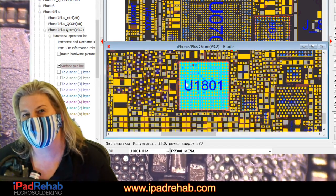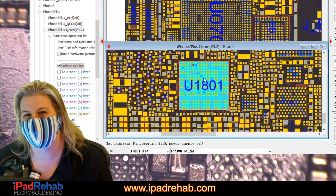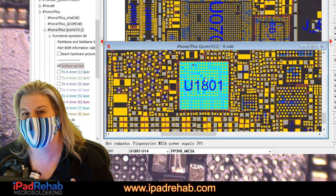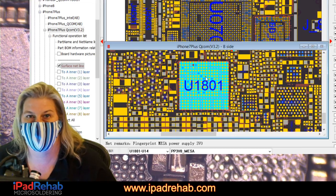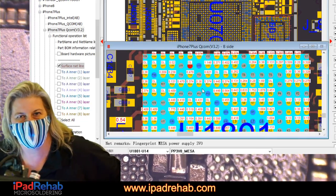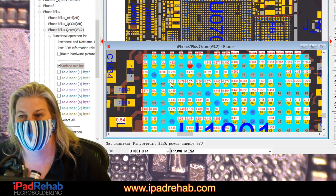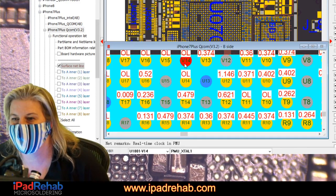We know that there's a very specific pinpoint within the power management chip that's getting hot. But it's unlikely that the power management chip itself is the problem, because it's completely surrounded by underfill. It would be really difficult for water to go in there and damage it, putting two balls together with corrosion. So that's unlikely. We're trying to guess whether there's something out around the periphery from the water damage. Is there some component, like a tiny little cap on some very tiny line that is a wire to ground? So we're testing different ideas here to find it.